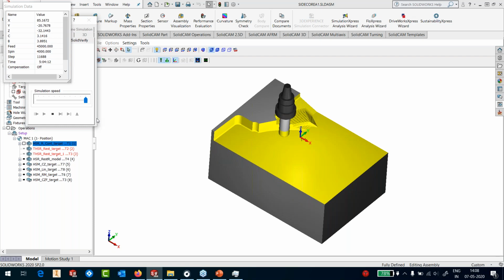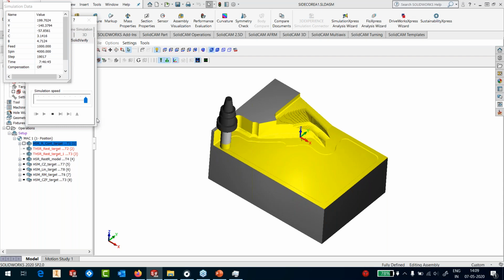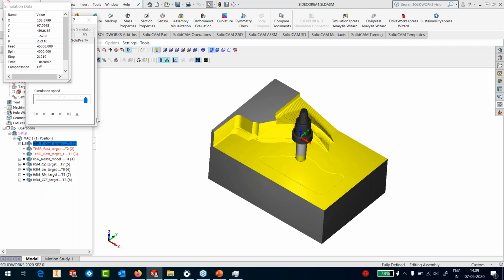Remember that I'm using a holder. The first tool has got a pretty long overhang, almost 90 mm. That's like three times the diameter, which is fairly good enough. It can rough out completely, but when I go into the shorter tools, I can't really go into those areas which are pretty deep. So we are going to see another new machining technique for going into the deep segments.